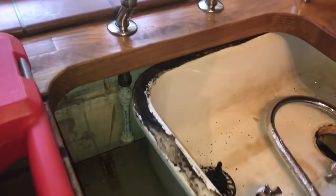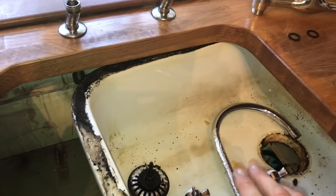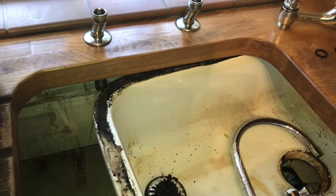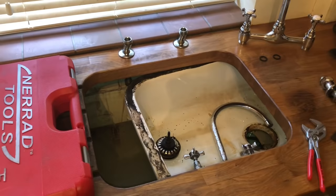On this model tap, the nut is captive on the leg, so I can't use the old legs — we're going to have to take these out. I'm going to slide the sink as best I can to get my arm in there and fit the new legs and do the tap. Sometimes you'll get a job like this and you'll just have to advise the customer: it's not just old tap out, new tap in — it's going to be hard to actually work on. It might take two hours, might take three hours, I might be on this all day. Just let them know before you start.